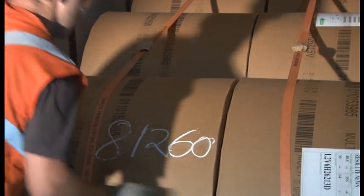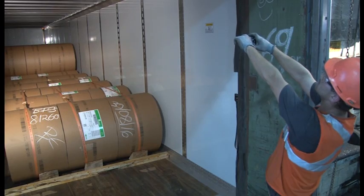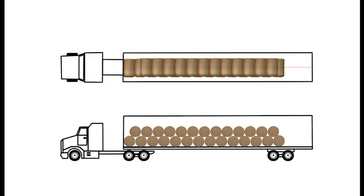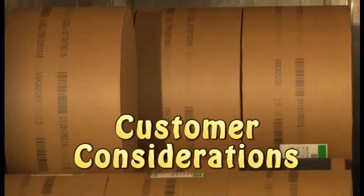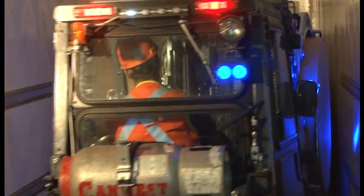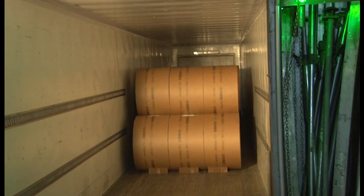For identification purposes, write the trailer number, trucking company, your initials and the date with chalk on the last rolls. Then, to complete the loading process, take a picture of the loaded van and another one of the trailer number. Note that if a second tier is within 3 rows of the doorway, then you will need to strap the last 5 rows and include the top tier or tiers in the unitized strapping as well. When a second tier is required, it needs to be a complete row that matches in size the bottom row. Top roll placement must be aligned with the bottom. This is done so that when a bottom roll is removed to unload, only one top roll drops down to the floor at a time.